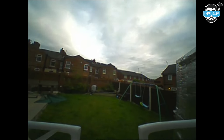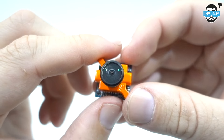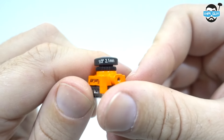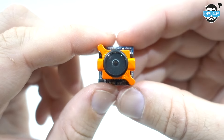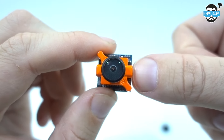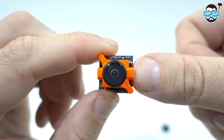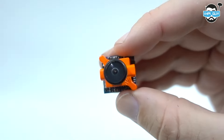Taking apart the Micro is very easy — there are only two screws on the rear holding that plastic plate on. Measuring the PCB against the PCB of the Runcam Mini shows them to be basically exactly the same. When you look at the components between the Micro and the Mini, they're almost identical, and the weight between the two PCBs is also identical — which is probably why we're getting the same image quality.